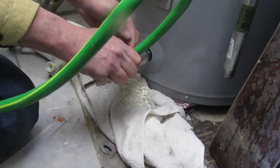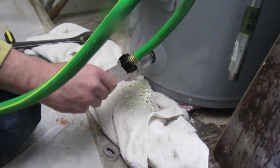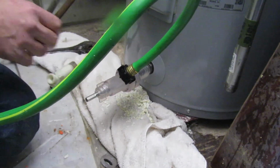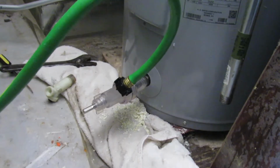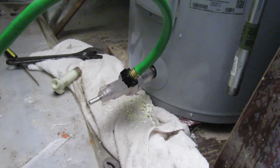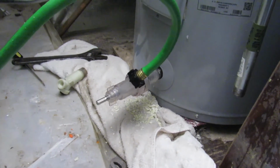Connect a common garden hose to the tool and run the other end outside to a bucket or to a safe area to dispose of water and sediment. Make sure that there are no kinks or restrictions in the hose. Expandable hoses are not recommended.